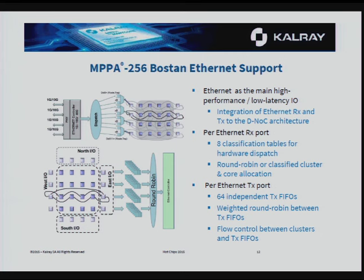And so we spent quite some work at the architecture level to merge the Ethernet termination into the network on chip. And it's not that easy, because Ethernet has big frames, and the network on chip must have small packets in order to be fluid enough so you have a decent quality of service. I will not describe more of the details, but basically, we can have the frame coming. We decide to balance them across the cluster and the cores, and then they are distributed onto the network on chip that itself implements the ring buffer structure you typically need in an Ethernet MAC.